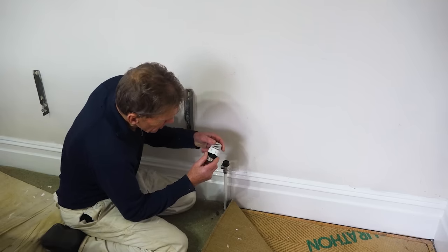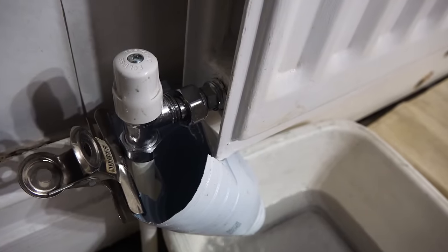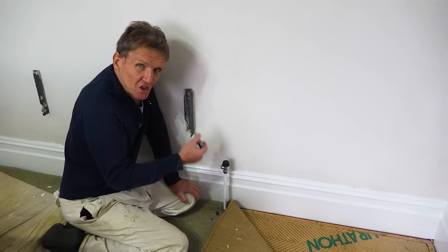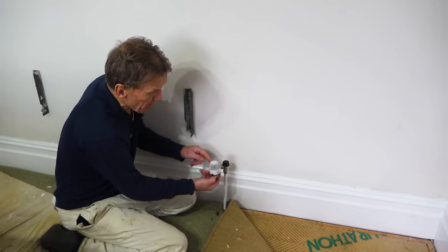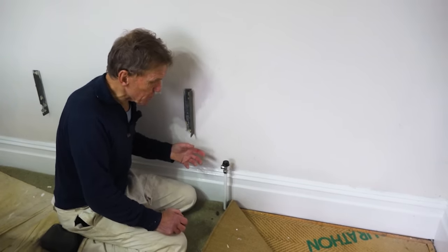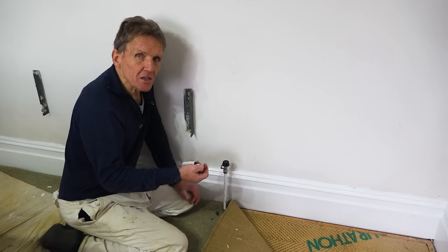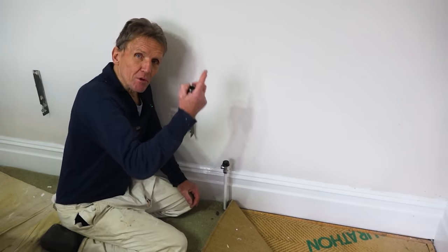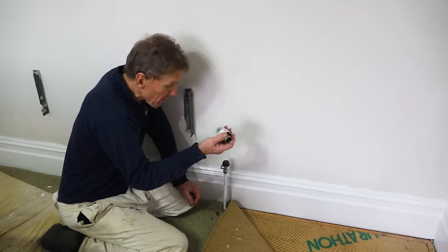A lot of people have got these now. You can turn these right off to zero, then drain the radiator down and get all the water out and lift the radiator off. But if you leave this head on, even though you've turned it down to zero and there's nothing coming out, what sometimes happens is as the nighttime temperature drops, this little valve will open up a bit on this head. So you'll get a spray of water. With a pressurized system it's not going to keep refilling, so once it's lost that pressure you're okay. But I've seen cases where people have left this head on all night, come down in the morning and found the whole lot flooded — they've been doing a bedroom and it's come through the ceiling and ruined the room downstairs. So not only have they got one decorating job, they've now got two.